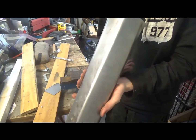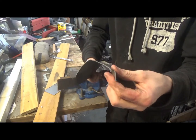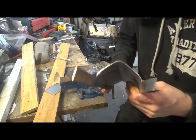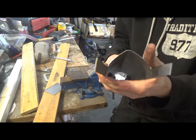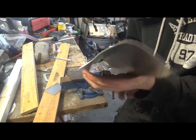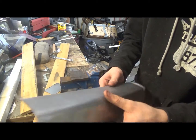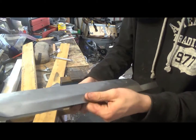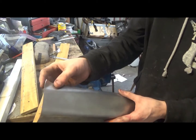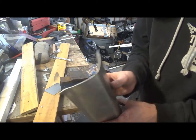So far what I have is the base of it — that part is cut out. These are bent to 90 degrees, parallel to the sides of my leg. You can see that this curvature is a lot more condensed, pulled in that way, than this one since the leg tapers — the ankle is skinnier than the upper calf. The main bend points are straight down the middle and about three-quarter inch in from the side. And then I just bent these parts out a little bit.